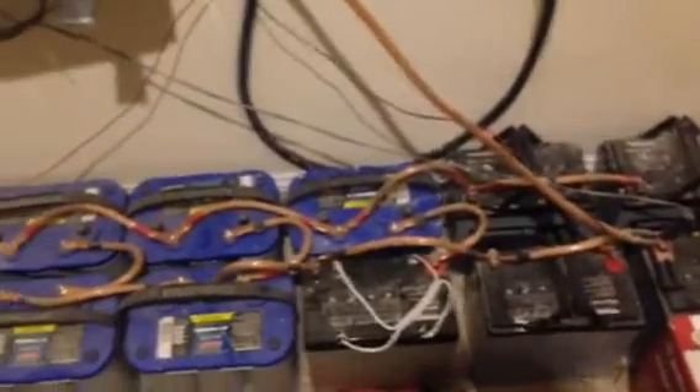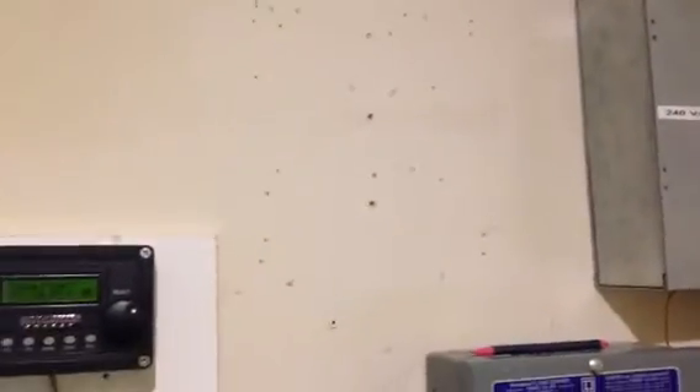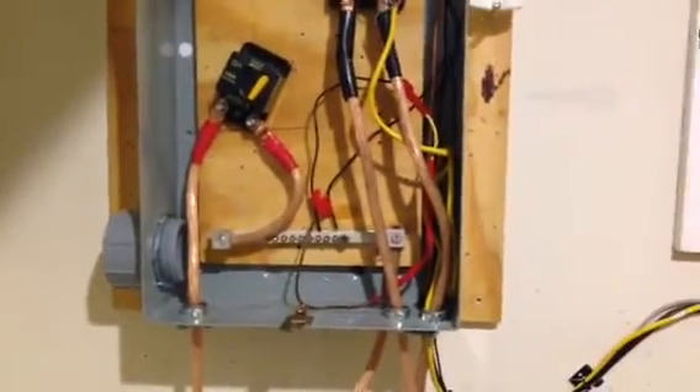In the event of a power outage, my batteries will be ready. With an AC coupled system, your battery bank is liable to die from old age as opposed to use. I've removed the diversion controller and the 250-watt grid tie inverter, and everything is greatly simplified. I've equipment-grounded this into the load center with copper wires going back to the main panel, so we're fine there.